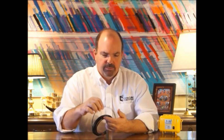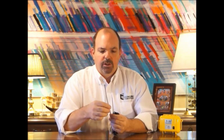We place a small sensor down inside the fresh concrete. The sensor looks like this — they're very small, and in fact they're so small that they can be reused in many cases if you can encase it down in a sleeve like this one. Then we attach the sensor to a maturity meter. This is one of our meters, and it happens to have two ports which allow you to monitor up to two locations, two sensors at one time.